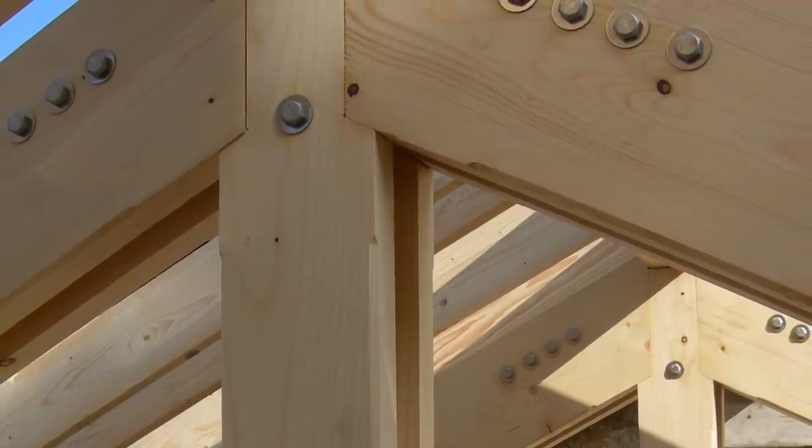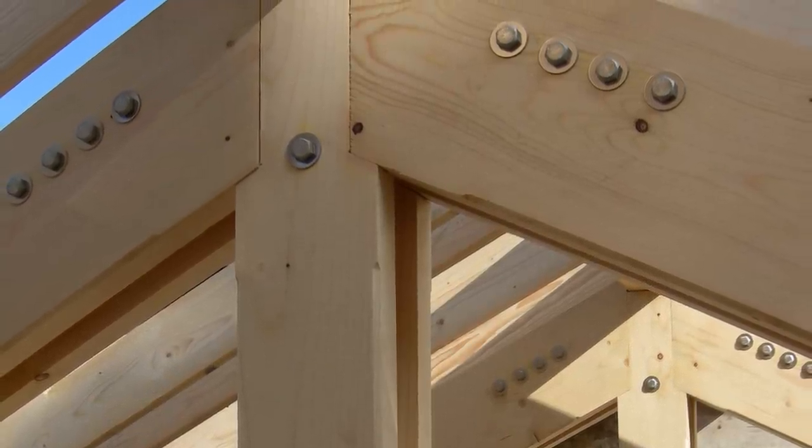The reason I said that is not because of poor scrimming, but because the timber is invariably wet. You're doing a roof structure and you've got sometimes soaking wet timber stored outside. You fix it all together, tighten up the nuts — go back a week later and you can get another couple of full turns on the nuts, showing how much moisture is leaving those timbers. If you haven't got time to let the timber dry out before plasterboarding, the timber shrinks. No amount of fiberglass scrim tape will stop that cracking — the scrim will just tear.